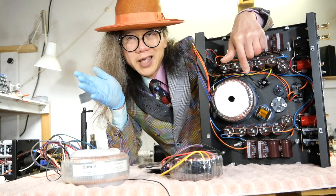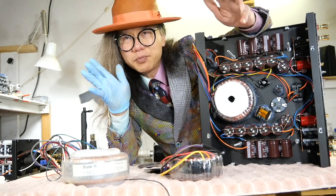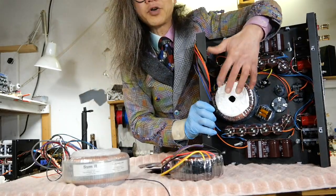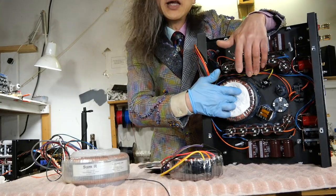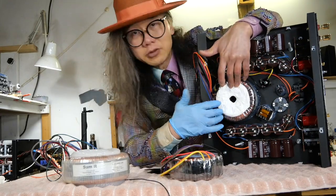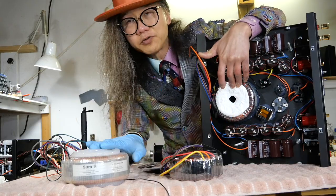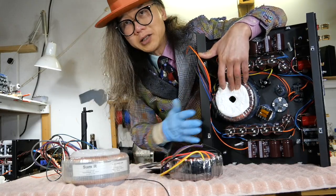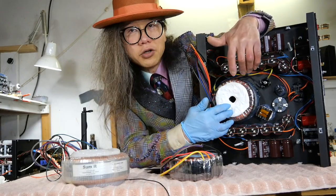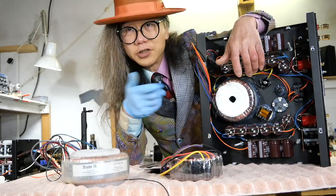When you ship a piece of equipment, you can't guarantee they are going to keep it laying flat. A lot of times it is sideways because of space, and you can't blame that — shipping is shipping. When it's shipping like this, you are going to shake the transformer, and the weight of the transformer is almost equal to the entire amp. This transformer is approximately 10 pounds, and every time it bounces it is going to be more than 10 pounds of force. Imagine the force put on the bolt and chassis — but in this case, there is no bolt in the middle; it is just held by silicone.